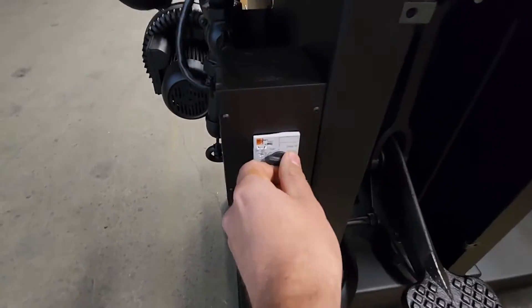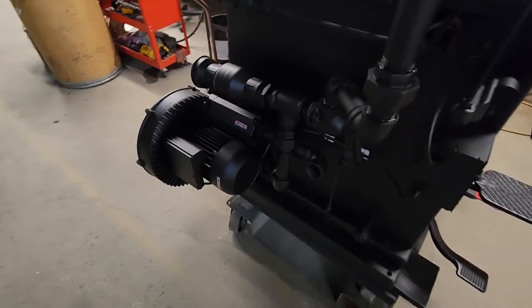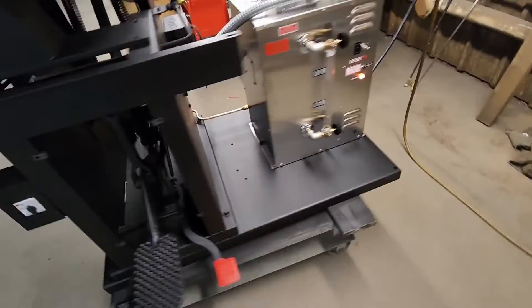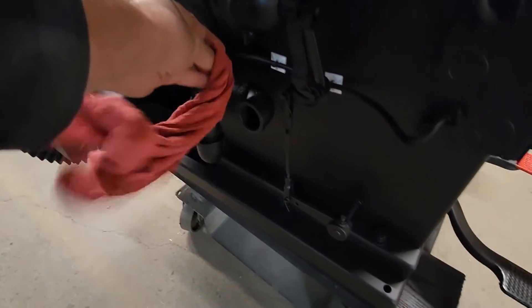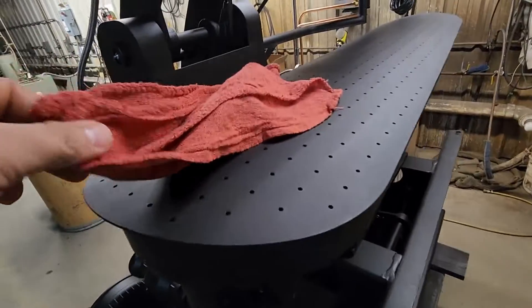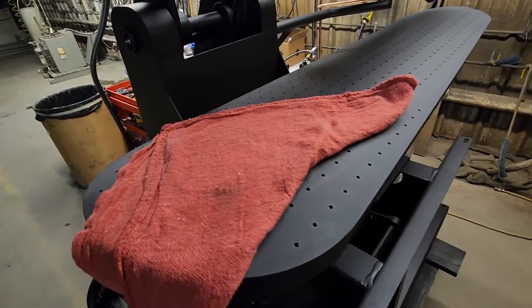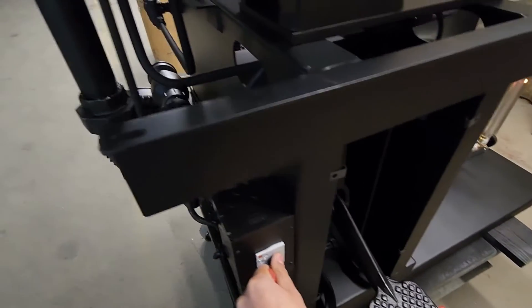To turn the blower on, come over here and flip this switch up. Here's the blower starting — three-phase blowers do start a little faster. When it's wired up correctly, this tube is your discharge and over here is your inlet. As soon as you press the buck vacuum pedal down on the left side, you can see the vacuum goes up to the buck, which allows you to spread your garment out. I'm going to turn the vacuum off now as it's rather loud.